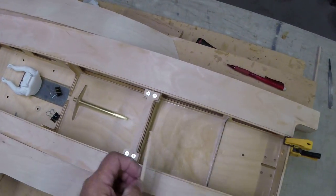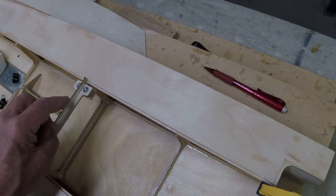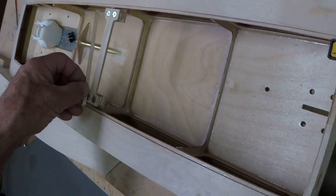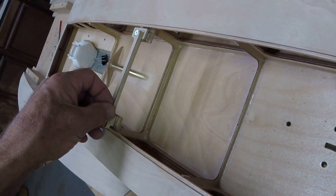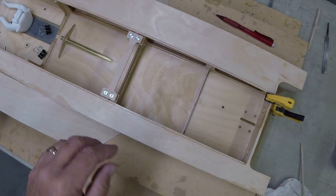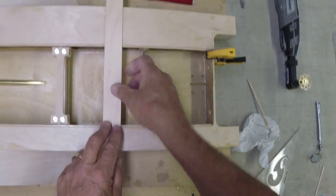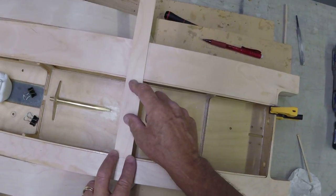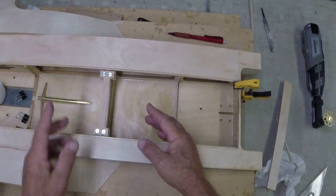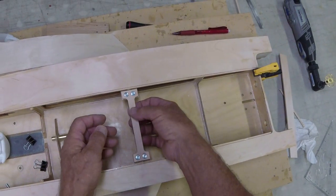There's my straight edge. I don't know if you'll be able to tell, but I'm slightly below the level of this inset portion here, which is good, and that's fine. Level or below. This one, I think, no, it's good. It moves, it swings. So we're going to lay something on there when I have this glue, and I think I'll cut another piece, maybe hack this guy into size where it'll sit down in this slot, and just sit it on here and put a weight on it. Yeah, just to keep them properly aligned. Walk away clean now. Tomorrow, a long time from now, when we're really, really confident the glue is set, you'll be able to remove this upper piece.